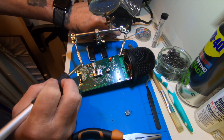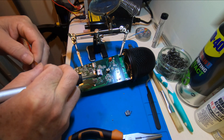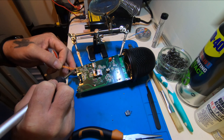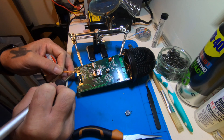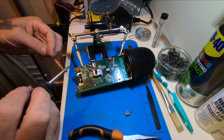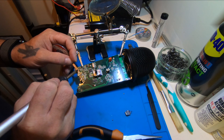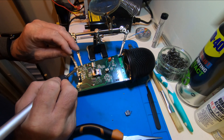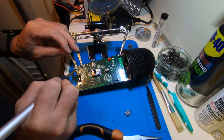Let's get a bit of solder wick and see what it can pick up. Let's clean that first. The big holes seem to be cleaning up quite well. The mounting holes have cleaned up fine. Let's have a look at these data ones. I've got wire left in these so I'm going to have to somehow get a hold of the wire or poke it through with something.